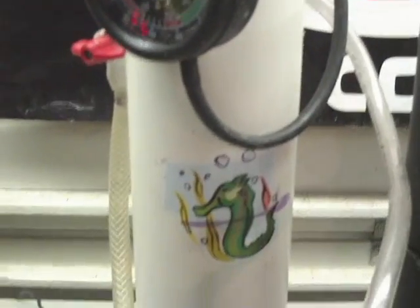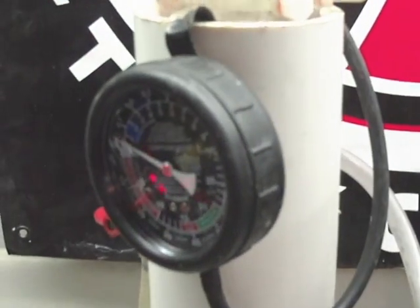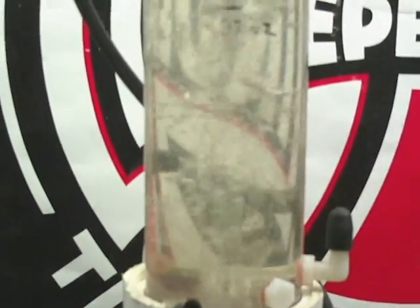So I'm not going to use the methanol — I just have to use a higher concentration of KOH. I've been running this cell now with a heavier mixture, this is actually two tablespoons of KOH for every 16 ounces.